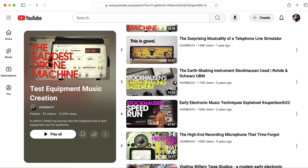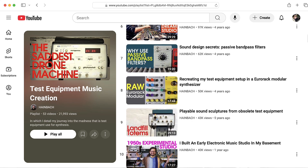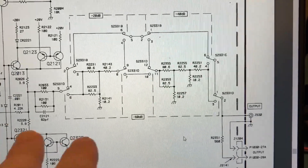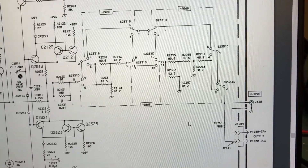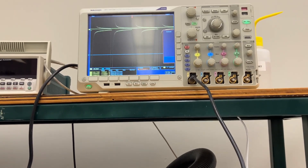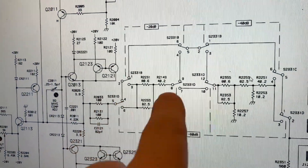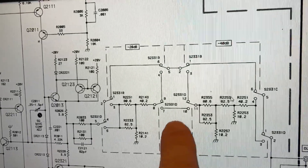My ultimate goal for all this stuff is I want to make an old school electronic music studio like Heinbach does. So it might be okay to just say these buttons don't work. The attenuation network is just right before the output — it's not really affecting anything else. The setting that's most reliable is the minus 60 dB setting; this seems to work consistently. That corresponds to this 2-3-3-1D switch, where all of these switch down to put all the attenuation in. So that switch seems to be reliable.